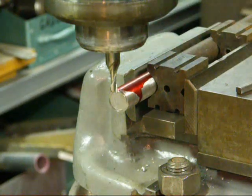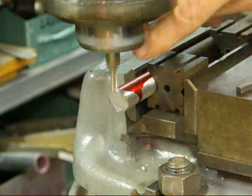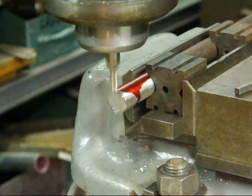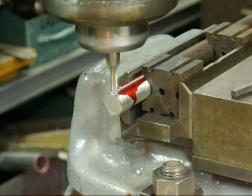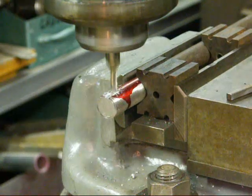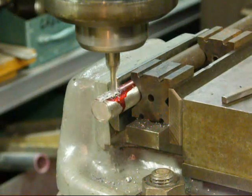Initially I'm going to take off 20 thousandths, so I'm dialing in my knee 20 thousandths, turning on the spindle, and I'm ready to feed it in to the layout line. I've already marked that on my digital readout so I'm going to come in to zero each time on the digital readout. I'm not using oil on that first pass so it will show up a little better — feed it slowly, don't break off that end mill. This is only 20 thousandths on the first pass.